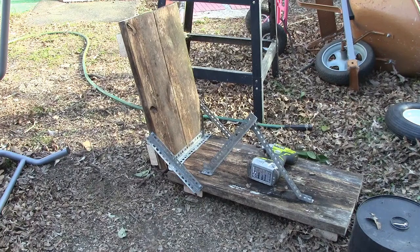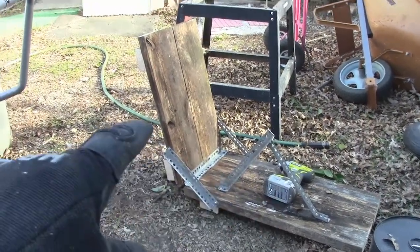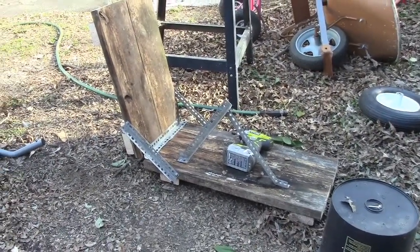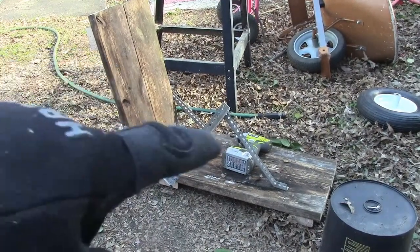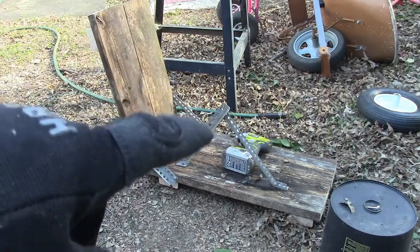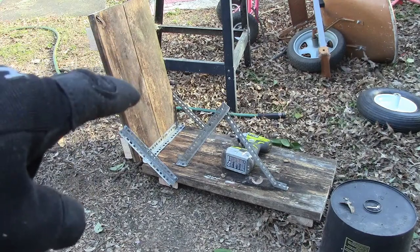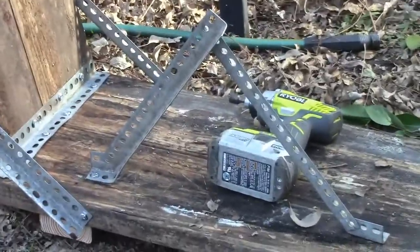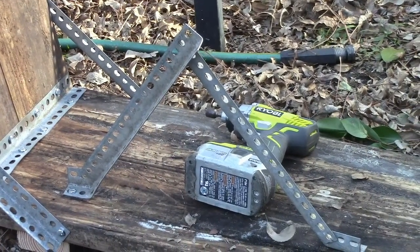The one shown in my other video is all metal. I welded the bottom plate and the back plate which holds the motor. But before I did that, I made sure that the angle that's going to hold the bottom wheel is going to be in the right position for the motor. I'll show you that later, but right now we're cutting the side pieces for the tire.